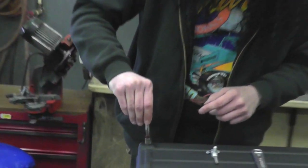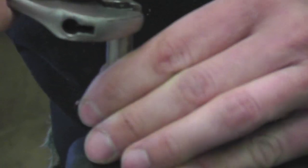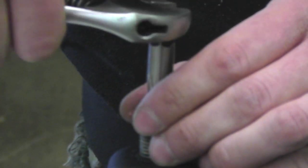Now, you're only going to want to go about halfway in. You want to try and get this as level as you can, because you don't want it cocked or angled or anything like that — it's not going to go in right. You're going to have to kind of ease it in to get it started. It's tough finding these parts for these sizes for some of these foreign-made threads, so this is how it's better to just tap this and put this in here. That way it's a little bit more common than trying to find a part on eBay or somewhere.